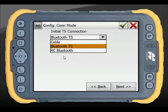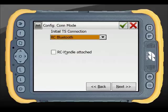With Bluetooth Total Station you will have the hybrid search function and the Find Me Here function on the map screen. RC Bluetooth means the data collector connects to the RC5, which then talks to the total station, giving you a range of up to 600 metres and the added advantage of the QuickLock function through the RC5.